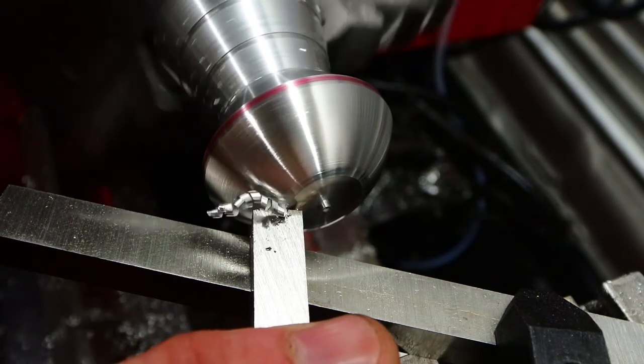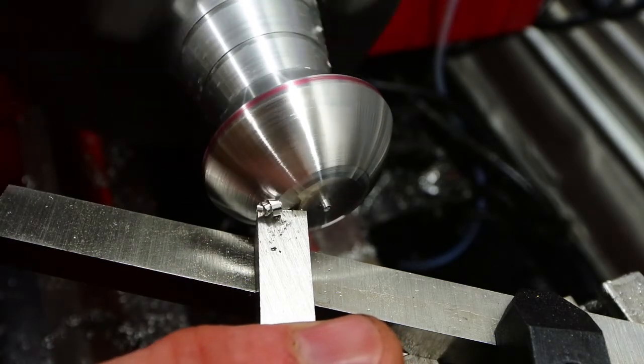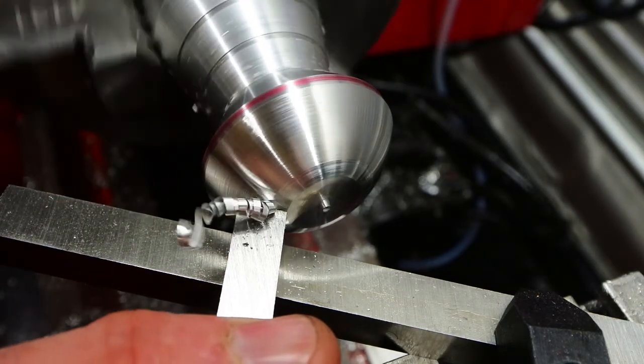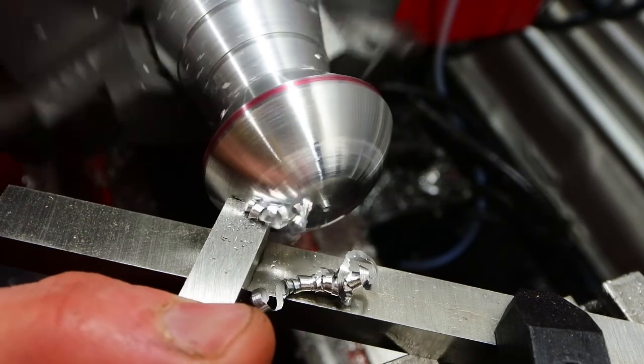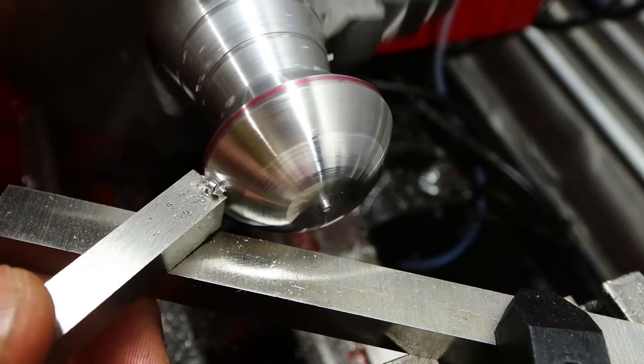Now this is normally the technique of the wood elf. If anybody has seen stuff fashioned on a wood lathe, this is how it's done. Using a rest close to the work and some kind of gouge or chisel that's long enough to control by hand, and you can feed it into the work and control how much you shave off.